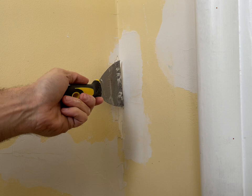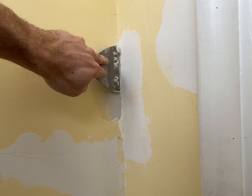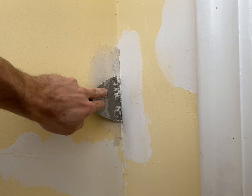I'll show you real quick on just this little area. Some of these smaller repairs — it's just a surface repair. All I'm trying to do is build up enough material to make it flat for paint. I'm getting enough plaster on my putty knife, I'll press it in as I'm exiting. I know where the low spot and the high spot is — the low spot is all the way in the corner in this particular crack — and then I'm going to feather it out over the high spot. You just want it as flat as possible, and I don't want too much material on there so I don't have to do too much sanding.